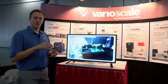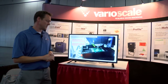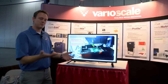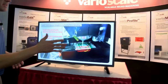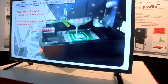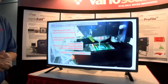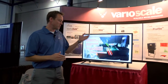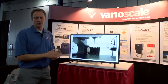After grinding, we're going to want to polish the chip and we have an automated tool exchanger that can do that. You can see it's spiraling — we achieve a surface randomization through a linear raster routine that's actually orbiting as it goes, much the way you would hand-wax a car to remove streaking and overlap lines. It has very sensitive pressure control and a non-fatal delamination mode.